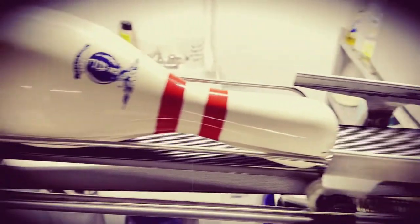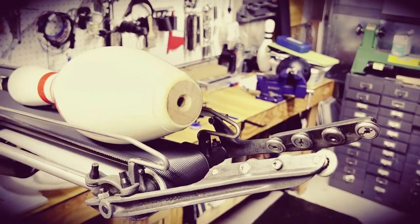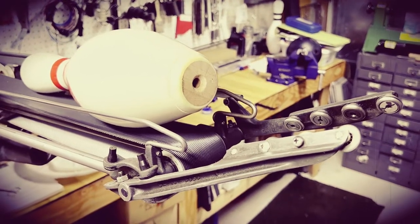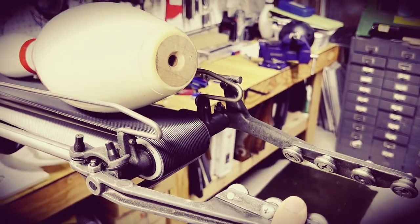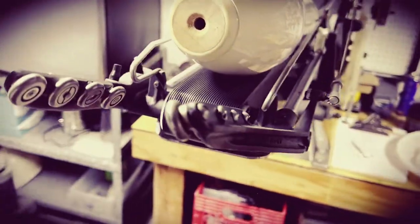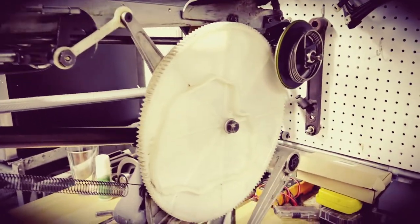As they travel up the belt, they approach the trip arms. The trip arm assembly is used to index the distributor from station to station. As the pin moves over the front of the distributor, it will trip these set of trip arms, hence the name. Each trip of the trip arms will then index the clutch at the back of the distributor and move the cam followers along the cam to move the distributor from spot to spot.